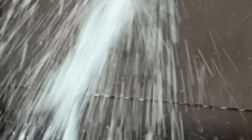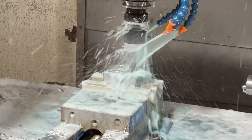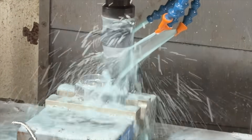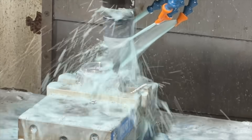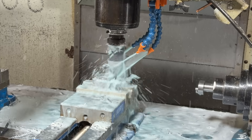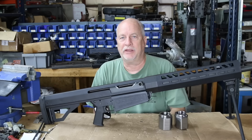In my last video about the trigger mag housings, I actually used AI — I plugged into Grok the G-code that does the spot drilling for all these holes. They were going all over the place back and forth over this foot-long piece and taking a lot of time. I told Grok to optimize them for going from one side to the other on the part instead of back and forth, and it saved 40 seconds — which doesn't sound like much, but it was a two-minute operation, so percentage-wise that's a big savings. AI isn't just for making crazy videos.